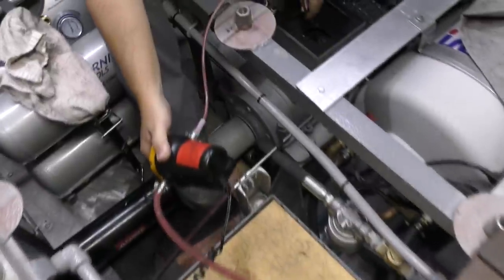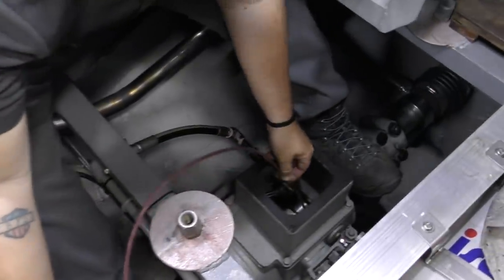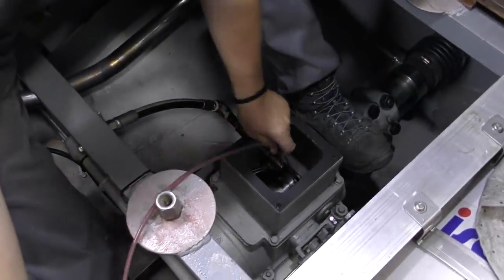This pump is turning out to be rather handy. We've got to get all the oil out of the variable pitch control unit, because we're going to change over from power steering fluid or ATF to motor oil. So if that pump springs a leak again and puts oil into the engine, it just puts in motor oil.